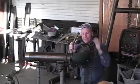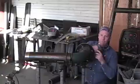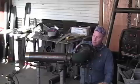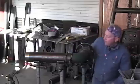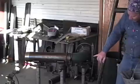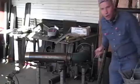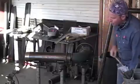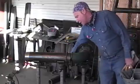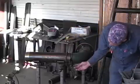It's riding the line a little bit on that side, but we're okay on that for what I'm using it for. Then I level my face of my flange. Just to show you another coordinate orientation, I go ahead and put that on the face of my flange so you can see it. I've got it right there. And this straight line level right here, according to the way that I'm trying to level this, it's good. Everything is in good shape. I've already put my piece in the jacks. I've got my vise clamps on it, my chain vise. I've got a piece of angle supporting this underneath, clamped together.